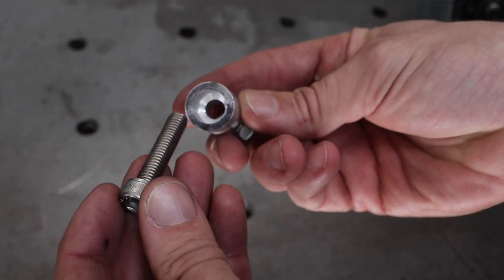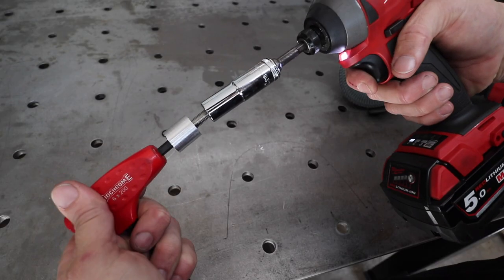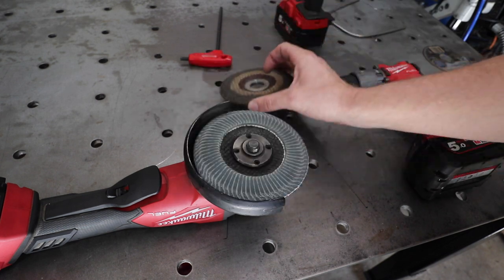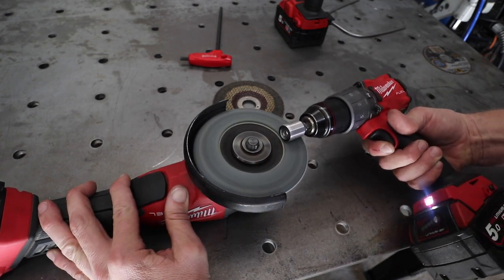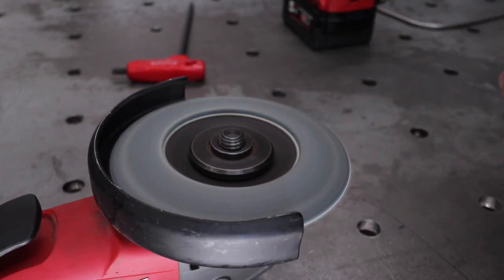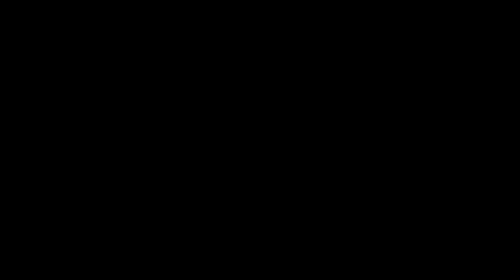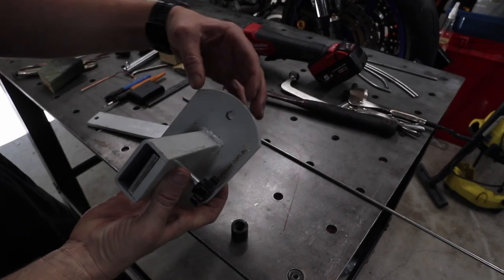All you have to do now is get a reasonably long bolt, put a nylon nut on the end, and do it up nice and tight. If you're making yours out of stainless steel or mild steel, use your grinding disc first and then finish off with a flapper disc — but I'm just using the flapper disc because I've got aluminium. Run the grinder and your drill at the same time and keep working until you get it perfectly centered. The first one will probably be a bit of a learning curve.